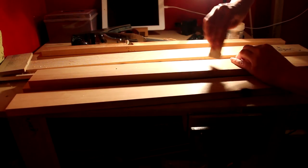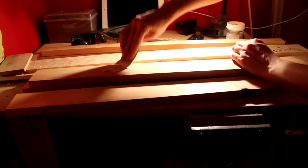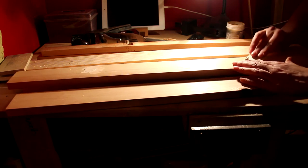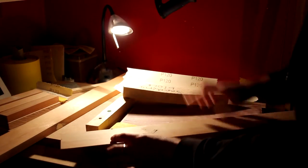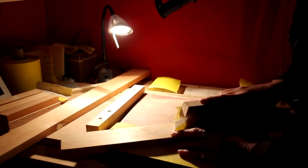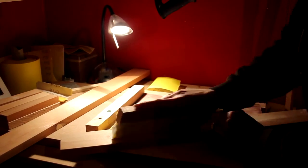There were also some screw holes which I filled in. This is just a one part wood filler which I then sanded by hand when dry. I've just got some 150 grit handheld block. Filler comes off quite easily, and just sands smooth with my planed wood.